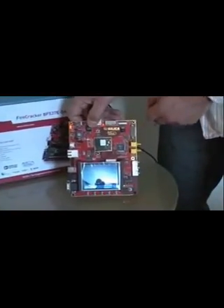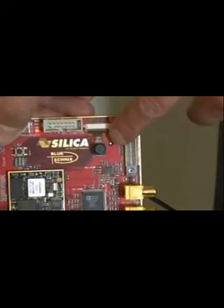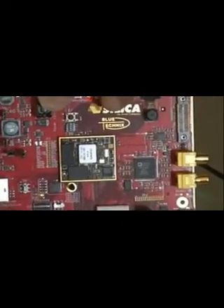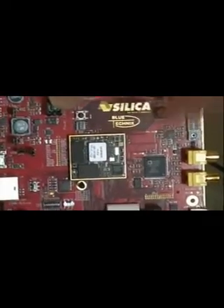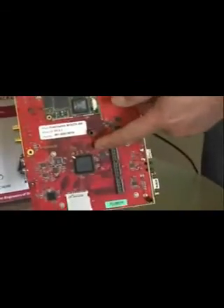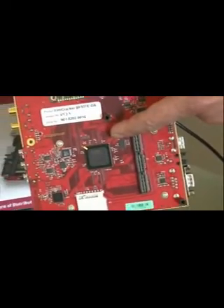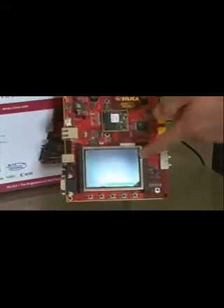You can now see the person videoing this demonstration. This application shows an image from the CMOS sensor, which connects gluelessly to the Blackfin 537 PPI port — the Parallel Peripheral Interface port — and then outputs that data over the external memory bus to the Xilinx FPGA, which is connected on the back. The Xilinx FPGA runs an LCD application which drives this LCD. This is just one of the example programs already pre-programmed into the external flash of the Blackfin processor on this board.